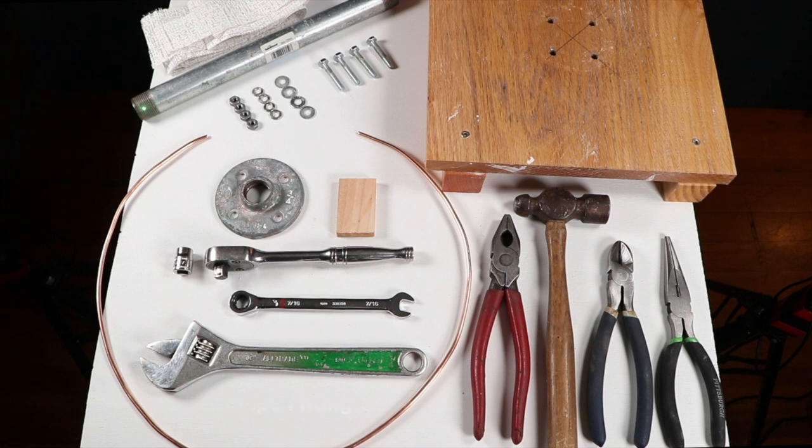You're going to need a steel pipe fitting galvanized nipple. That's what this is called. It's a 12-inch, 3/4-inch pipe. Make sure it's galvanized, make sure it is steel. You do not want to use plastic. Again, we want this as strong as possible for any type of idea that you want. That's really the point, is that you can get as big as you want, with rationale to the balance of the 12 by 12, but good solid steel galvanized piping. Make sure it's 3/4 inch so it fits inside that flange right there.